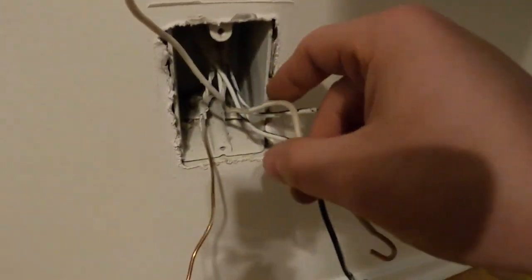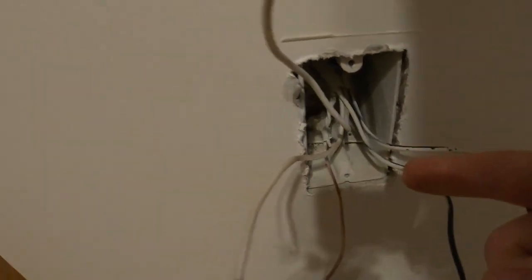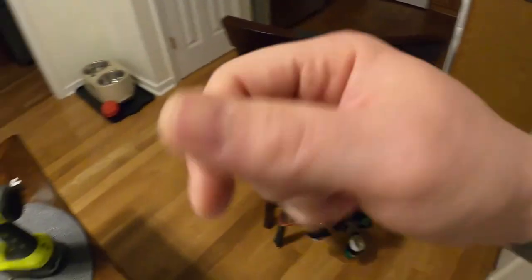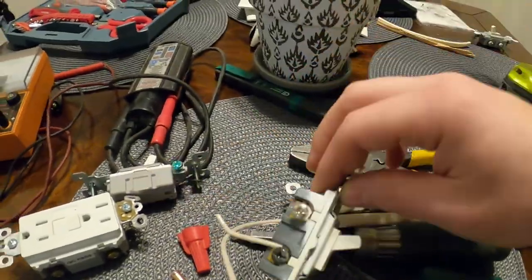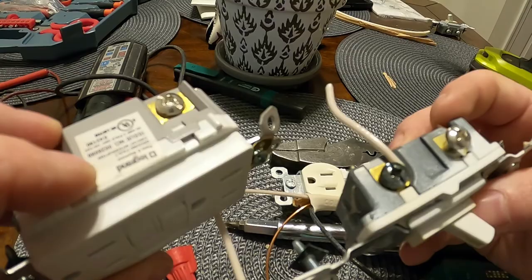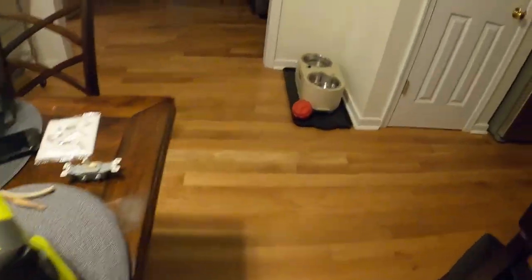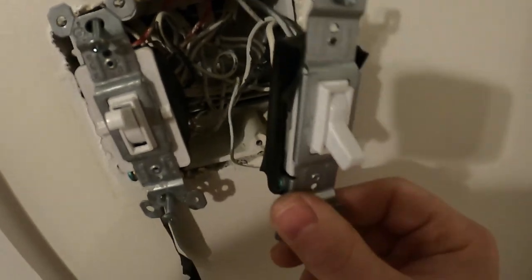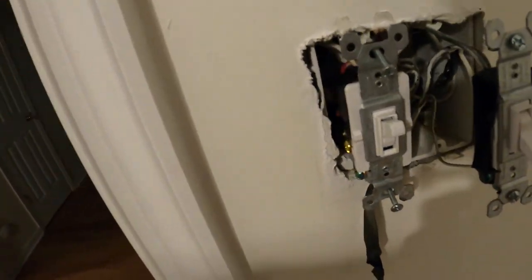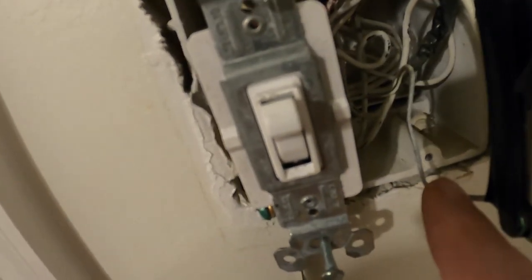Make sure you don't see any nicks or anything like that in the casing. If you see any copper or any nicks in it, wrap it up with some tape and it'll be fine. Obviously if it's been so bad where it's like breaking, that's a different thing. Also, before you put all these back in the wall — whether it be a switch or a receptacle — I always wrap mine in tape. Look at all the wires in there; this is a bare wire right here. If this rubs up against the device or the box when there's no tape around it, it can set off arcs and cause tripping.